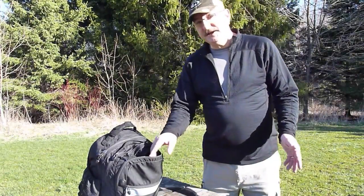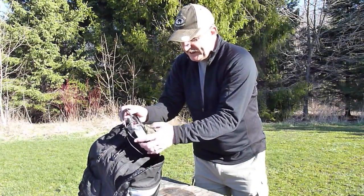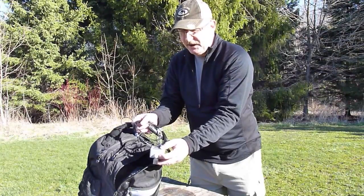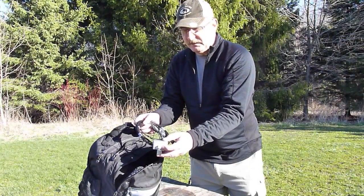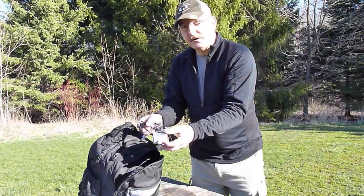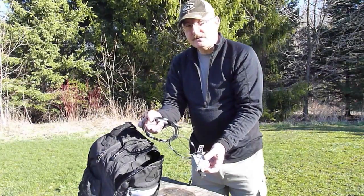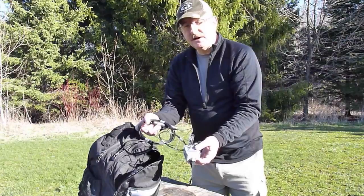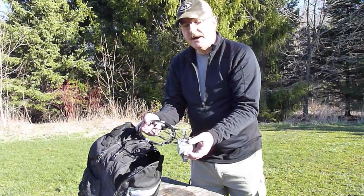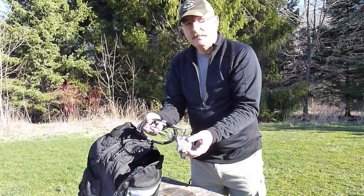It's time to take a look at the antenna itself. Ron at High End Fed was kind enough to send me one of his three-band classic antennas. This is a 100-watt antenna with an SO239 connection. There's also a backpacking lighter-weight version available with a BNC connector. Ron also now has one rated for 150 watts. It's 40 feet long and covers 40, 20, and 10 meters. It can be used on other bands with a tuner. On 40 meters you should expect about 200 kilohertz of bandwidth, on 20 full band coverage, and on 10 approximately the lower 1 megahertz of that band.